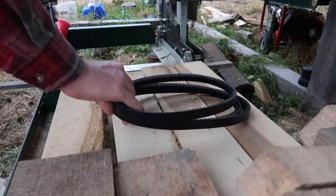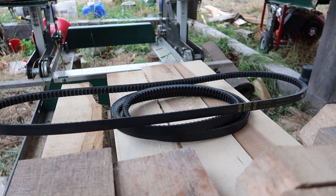Welcome back. So last week we put up some studs and did a little bit of milling. As you recall, we had a bit of an issue with the mill — the belts are getting kind of old, particularly the one on the follower wheel. That one has stretched a little, so there's extra slack allowing the belt to pop off the wheel. Last week I ordered new belts, and those came in early this week. We're going to try getting those on today. Even though we only had issues with the follower wheel belt, we're going to replace the drive side belt too, because that's starting to show signs of wear.